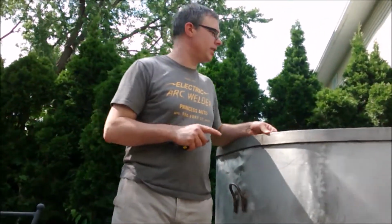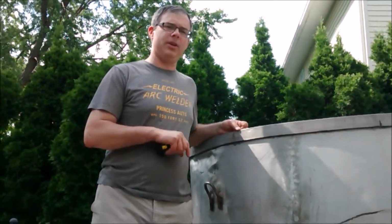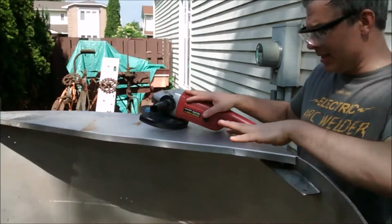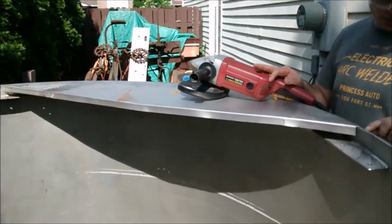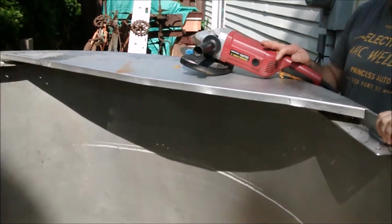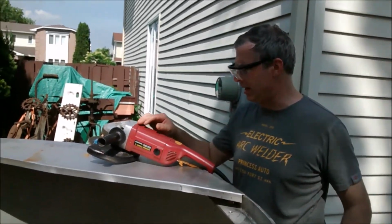But first things first, I've got to remove a part of the top. So I'll do that, and then we should really have the shape of the hot tub down. Okay, you can see in here there's the 2.5 inch valve, our fitting. There's another 1 inch on the side that's got a plug in it. I have to get a stainless steel plug rather than just the iron in there. I'm going to take this off. This was just welded onto the top of this thicker rim here, so I'll run the angle grinder along that with the cutting blade on it.